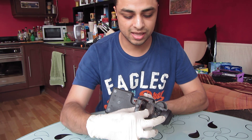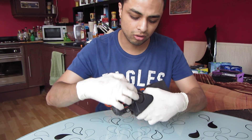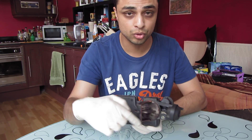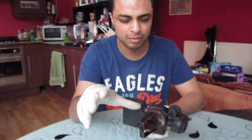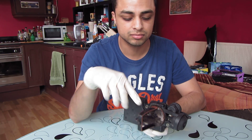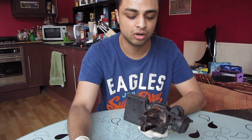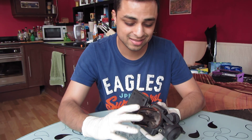That essentially shows that as the flap moves and rotates, there's a little hexagonal or octagonal shaped gear in here and that rotates and pushes the piston. If this rotates and the piston doesn't move, it essentially means that gear has become rounded off. So instead of a hexagonal or octagonal shaped gear, it's completely rounded off. What would happen is if you rotate it, it would just stay there — there's no tension from the pump pushing it back into its normal position. So far so good; this DISA looks okay.